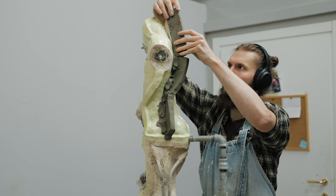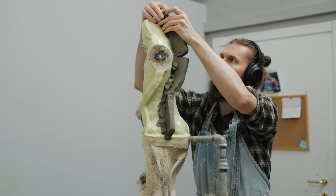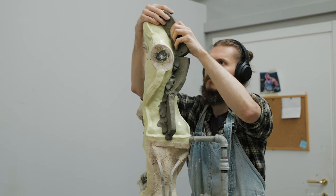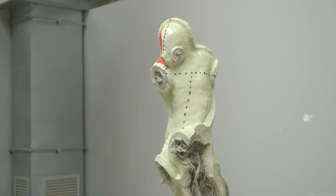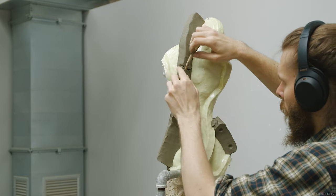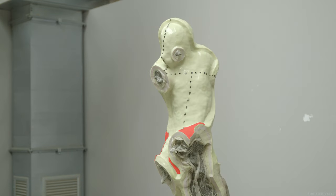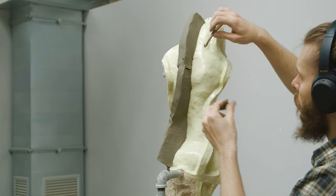Now from the front here, we're running into some serious conundrums. We can't split the model mold in half because we have multiple undercuts happening in different places. We have an undercut right here at the top of the head, and if that was it, we could split the piece into two. That's not the case, however — we have two undercuts per thigh, which means splitting the mold down the middle will work for the head but it's not going to work once we get to the thighs.